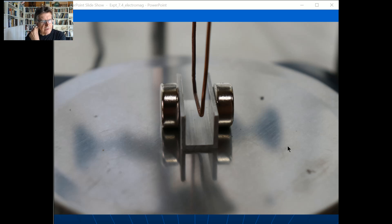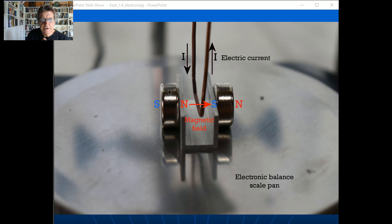Here's a close-up of the magnets with the piece of wire going through them. In the next slide I've labeled the poles north and south. When you've got these button magnets it's hard to tell which side is north: I just place one on a flat smooth surface and let it orientate — the side that points north is the north pole. I label them with a felt pen, then when you put them either side of the aluminium channel the unlike poles attract, so they sit there firmly.